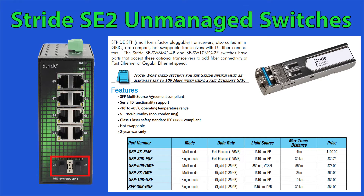Why would you want a fiber connection to your switch? Fiber offers a greater connection distance. Standard CAT5 Ethernet cabling is limited to 100 meters or 328 feet, whereas the distance for the SFP fiber connection is determined by the module you select. This list shows the modules we currently offer and their specifications. The max distances for these modules span from 550 meters to 30 kilometers.